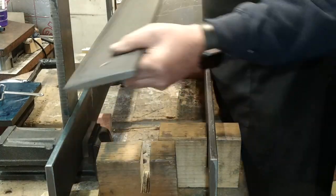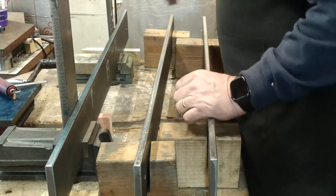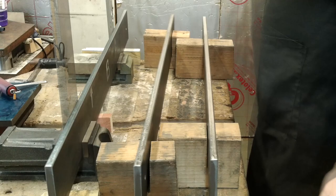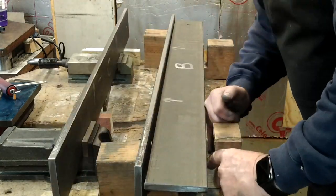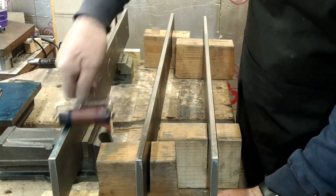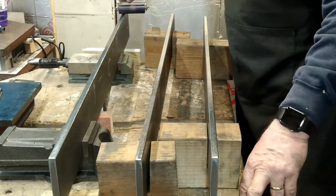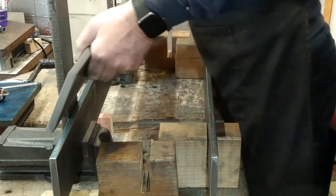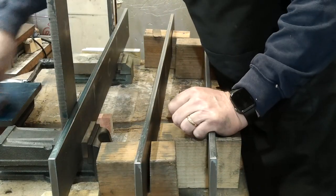In this part of the video I'm showing you the full sequence: B is checked against primary plate A, then C on plate A. I then rotate both secondary plates by 180 degrees, check B against A, and finally C against A. After each check I use the scraper to remove a little material from the high spots. Next, the primary plate A is changed to plate B, then I compare plate A to B, then C to B. Rotate the secondary plates by 180 degrees and check A to B again, then C to B. This process is also continued with plate C as the primary plate. That's the complete sequence.